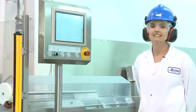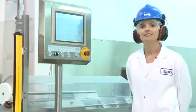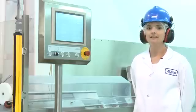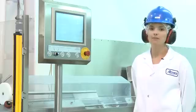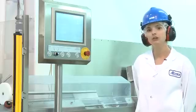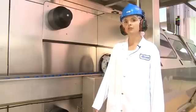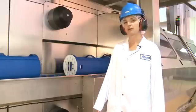The end of the high pressure processing cycle will be marked with a loud noise. There — you've heard the depressurization of the chamber. The cylinder will be moving back into place, the water will be draining, and the product will be moved through. Let's go to the other side and see the product. Pressure releases from the vessel, the water pours out, and the cylinders are pushed through by the next batch of product.